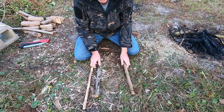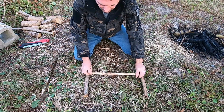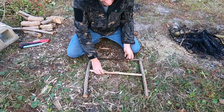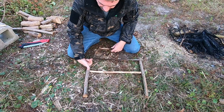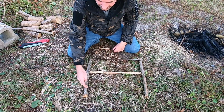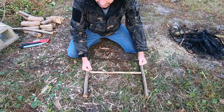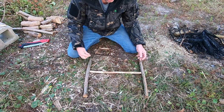So what we're going to do is start the construction. We need to make our cross members with our uprights and then we're also going to be splitting and putting our buck saw blade down here. We'll whip it and then find out exactly where we're going to put everything — probably about six inches up from the top of the blade. We'll leave these uprights for now and won't trim them down until we get our windlass tied up, so we can adjust to keep any rocking.